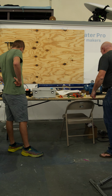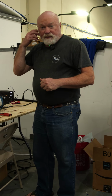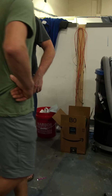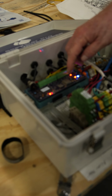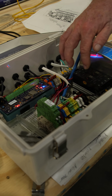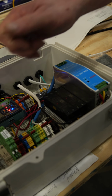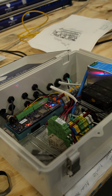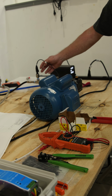Okay. And so this is Wi-Fi controlled. If you want to show the inside of this controller box, that would be fine, because this is the controller here. It has Wi-Fi and NMEA2000. And these are solid state relays that run the various boost pump, the compressor, flush valve, and the diverter valve. And here's the high pressure from the compressor output.